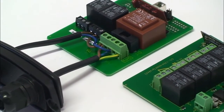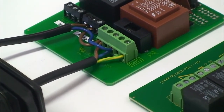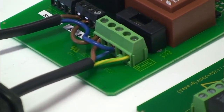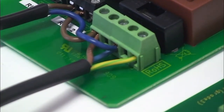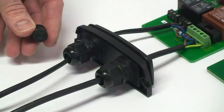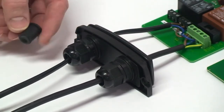Note that the examples provided show a mains lead, but as the relays on both models are completely isolated from the supply, any load within the relay's ratings can be switched. Wire according to your application, referring to the relay connection diagrams available in both the quick start guide and the Viper remote control datasheet.